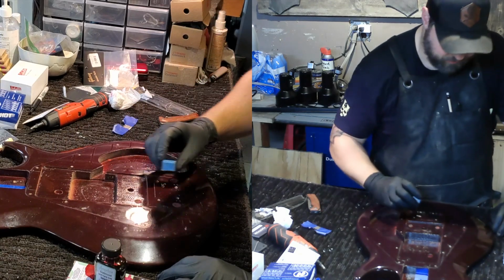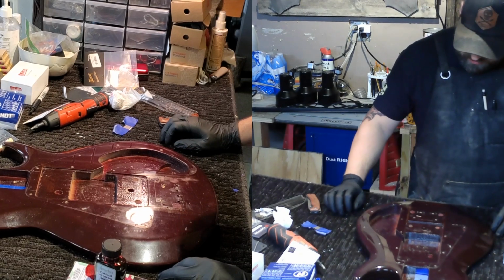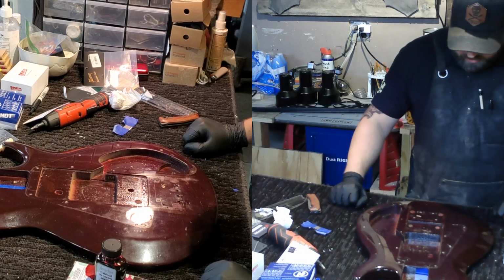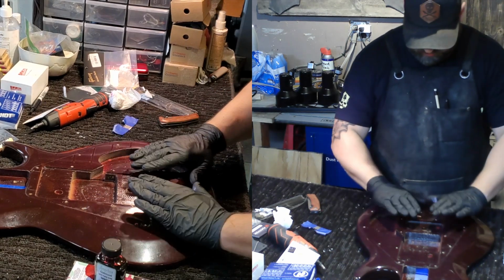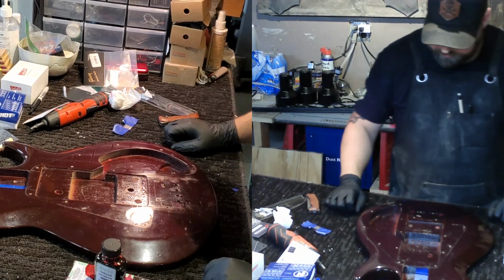I know this is going to wear off a little bit, and it's going to take the top finish off. So as long as I can get it really, really smooth, then I'll reapply the dye so it'll soak in more. And then right before I'm done, I'm going to tape off everything, and then, like I saw before, I'll just spritz it with the lacquer.